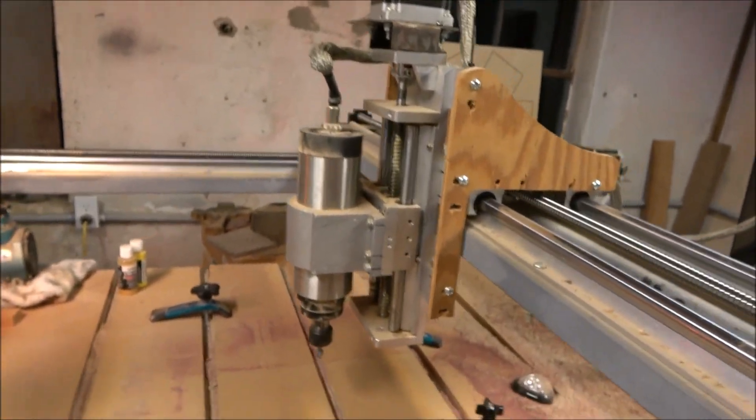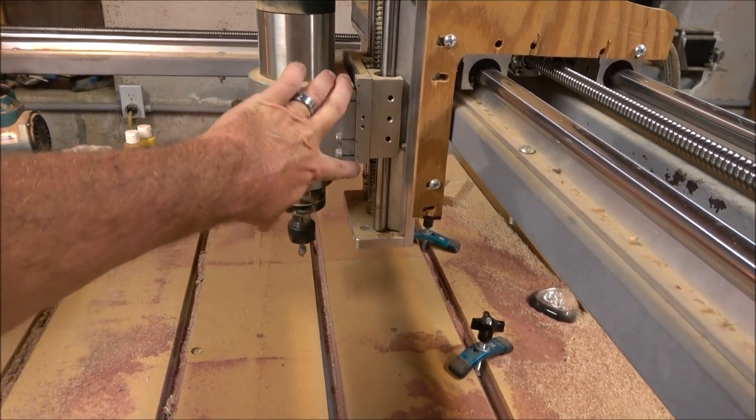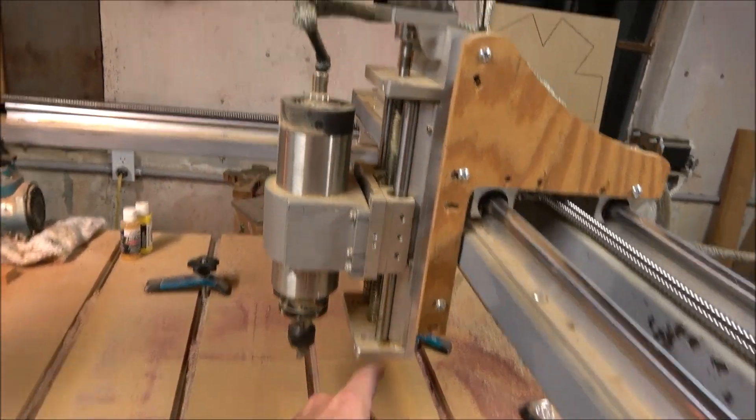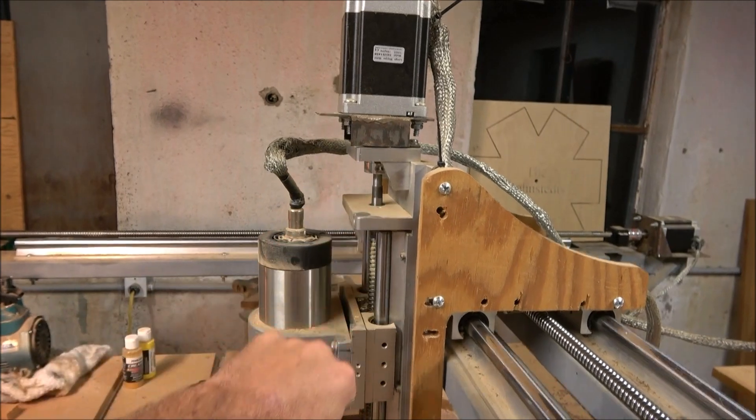People hear me talking about the Z-slide on my CNC. What I'm talking about is this piece of aluminum right here — all the way down to here — where the spindle mounts to it. From here out is the spindle; from here to the back is the slide. You can see there's a ball screw inside run by a stepper motor. I mounted it with brackets I made myself, and it allows it to move up and down. I ordered this piece — didn't build it myself. It cost just over $100, and the time it would have taken to build it would have been tons. It's a precise, well-made product and I have links for it.